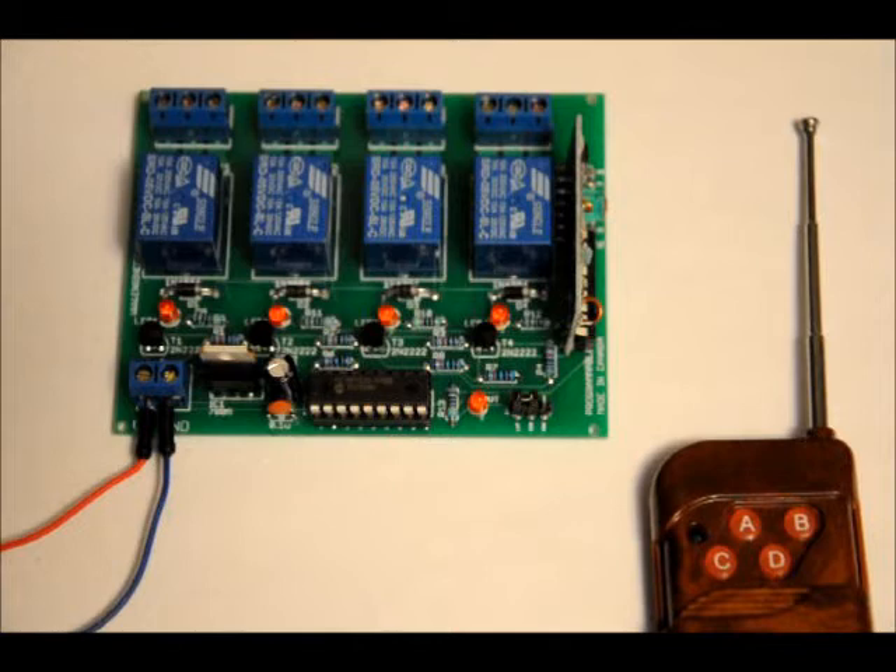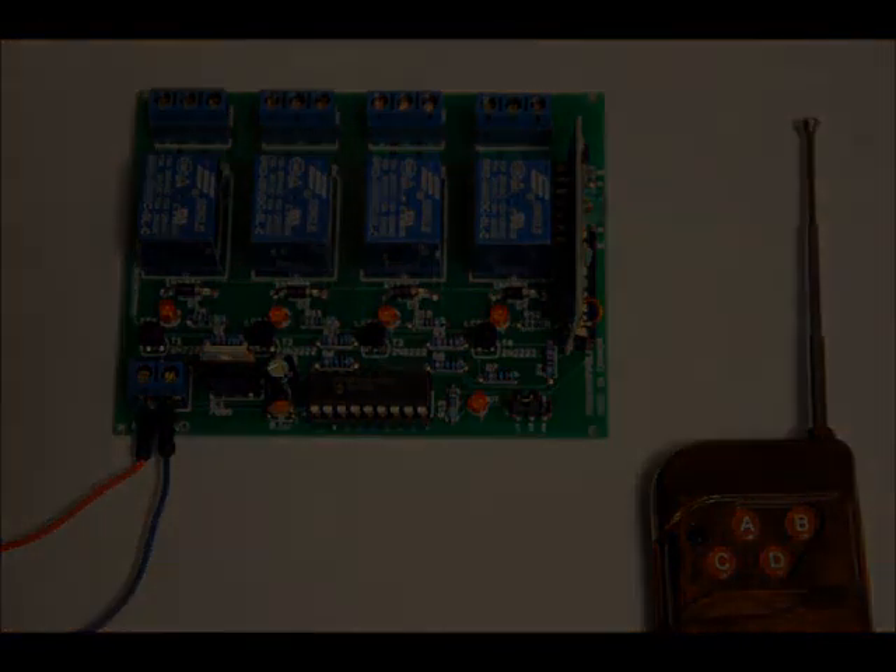And there you go. I'm very happy with this board, except for the little wire jumper issue — but I think that's pretty forgivable. It's a good-looking board, it's reliable, and it's got good range. I'd say easily 25 to 40 meters, and probably close to 100 meters if you get that antenna soldered on. There are four mounting holes — small, but if you have the right hardware it shouldn't be a problem. The traces are very thick, good for power transfer. If you have any questions, please don't hesitate to ask. Thanks for watching, everyone.